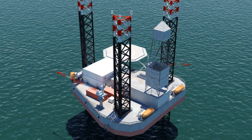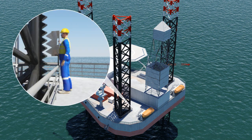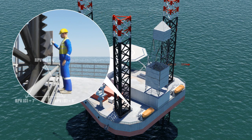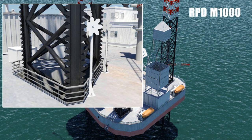Raising and lowering a jack-up rig involves engaging drive motors in the racks on all three corners of each of the three triangular legs. Traditionally, monitoring RPD progress is by checking with a hand-held measuring gauge — a rudimentary practice using after-the-event, non-real-time readings easily open to human error.